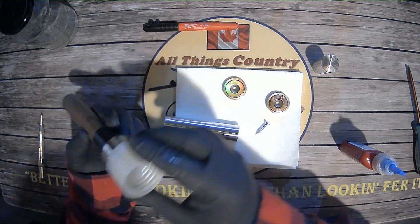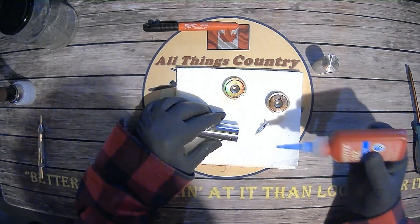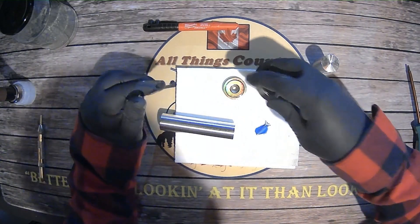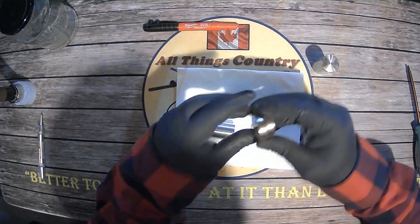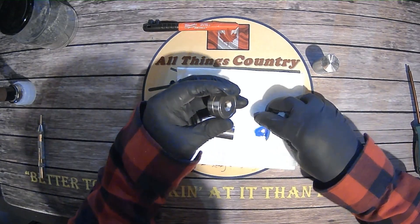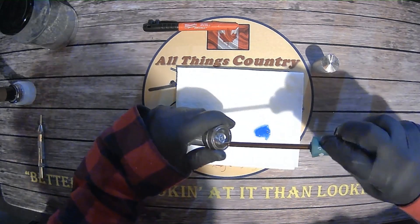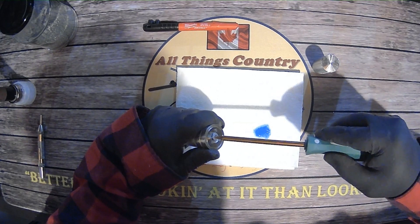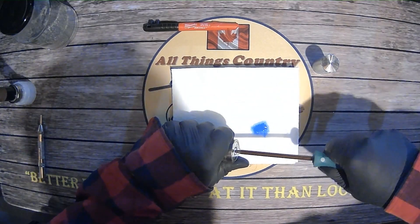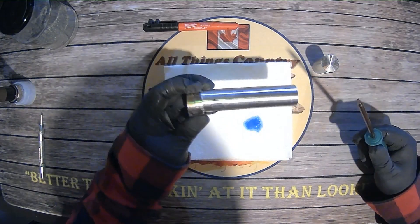I've taken my regular paydirt magnet to hold the washer and cap in place while it's still curing, allowing me to get these two neodymium magnets onto my shaft. First I'm going to put some blue Loctite on the screw. Be careful not to get your finger between those magnets because they're bloody powerful. Get the two magnets aligned and stick the screw right through the hole — keeping in mind the screw is magnetic as well. Screw it onto the shaft, find the Robertson hole, give it a few really good tight turns. You might have to loosen it, realign your magnets, then tighten them back up. And just like that — boom — there's your magnet.